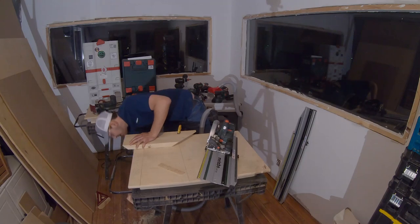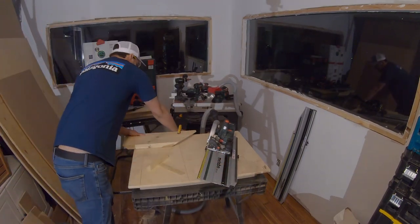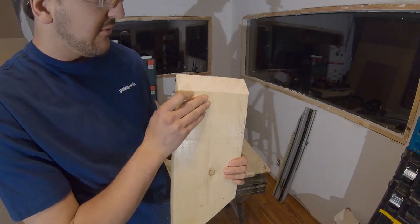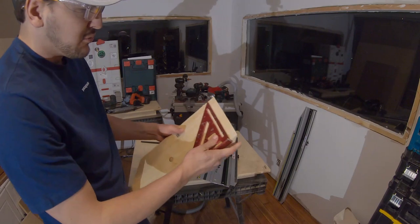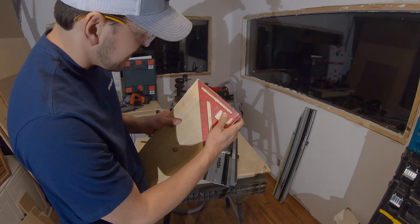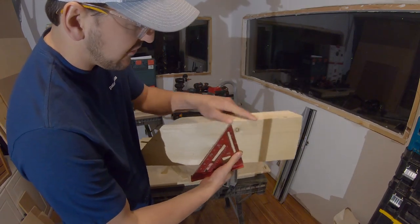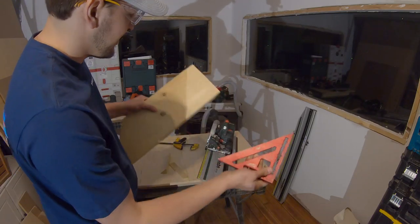Not a lot of guesswork out there, and my gosh, that is an absolutely buttery clean cut. I mean, for a piece of rough frame material, I don't know many people with a circular saw other than maybe Roof Slayer that can make a cut that smooth, that straight, and that quick. If you notice, I didn't even have to get a speed square out. And that is one thing you've got to pay attention to with a crosscut saw like this. You really have to be paying attention, otherwise you won't get a square cut. And I've got to say, for a piece of rough, wonky framing, that's out less than a 32nd, probably. The edges of this are all torn up. You're just not going to get a straighter cut. So if you can get that within a 32nd of an inch on a 2x8, you're doing pretty good.